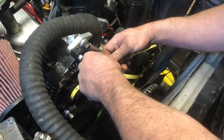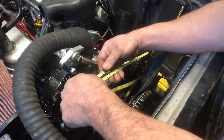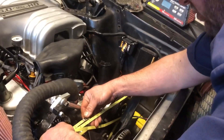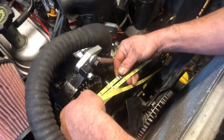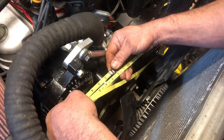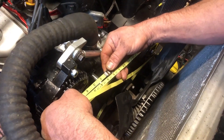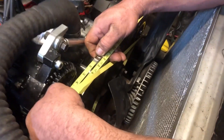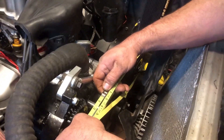I did have a belt that was too short — it was a 60 inch. So I guessed I should be around 62 inches or so. And measuring it comes right to about five foot two, which is almost 62 inches — exactly where I thought it would be. So since I have this adjustable rod, I'll probably get a 61 and a half inch belt.